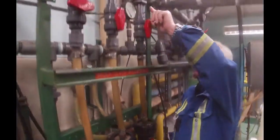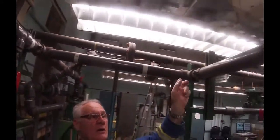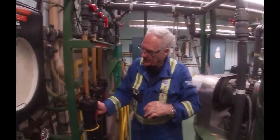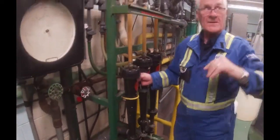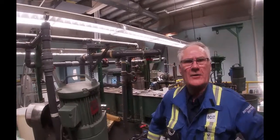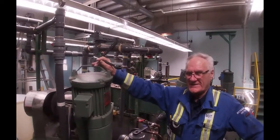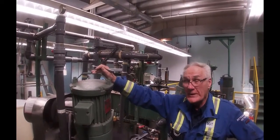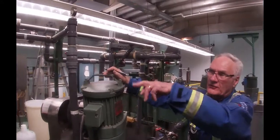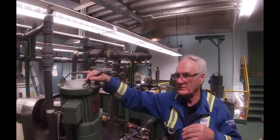The accepts come up the top and go onto this line here. The stock comes back along through here and drops into the tank. We have to keep a back pressure on these things to work. You've got supply pressure coming in at around 40 to 42 psi. The back pressure we run somewhere around 10 psi, so you get about a 30 to 32 pound pressure drop. We had looked at the whole idea of putting a valve on there to automate it, but the process was over so fast that it didn't make sense. What we would do is measure differential pressure and control it to maintain a 30 psi differential across the actual cleaners themselves so they hydraulically function properly.